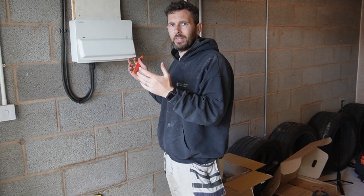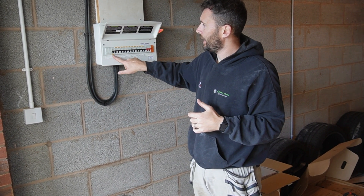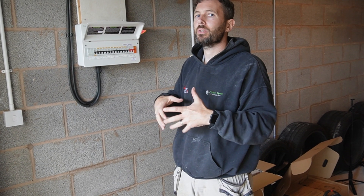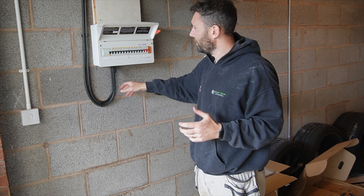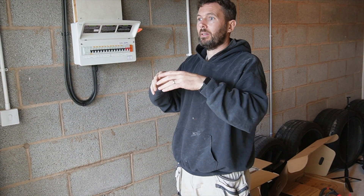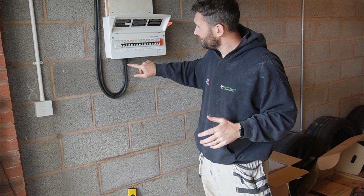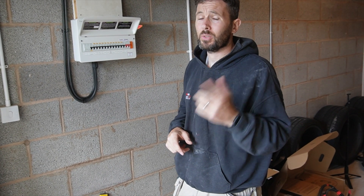Coming to the end of this job. One little tip: use the stud buddy to hold the cover up. I've changed the RCBO in here — these are the mini RCBOs, and the reason is that mini RCBOs are double pole switching, which is what you need as a basic requirement for your EV install. We've done all our testing on that. We've also put the hob circuit in — the hob is a 600 and we're now going to make it an 800 or 900 hob. It's gas at the minute and it's all going to be all electric. We've put our swooping bends in, used the storm gland for the armoured, and we've just done the initial setup on the Zappi.